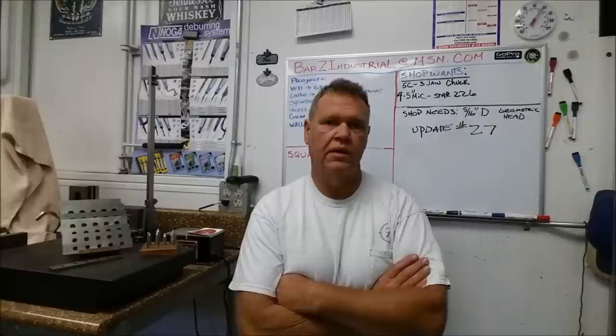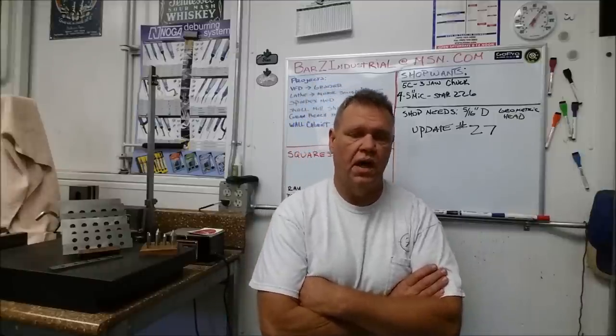Simple bearing service made a world of difference. The Boyer Schultz is good for another 30 years hopefully. I priced the bearings while they were out — they're still available, about $180 each. They're not angular contact, just a deep groove bearing in a high-tolerance spec. I opted not to replace them. I had about two hours into pulling that spindle out, re-greasing, and putting it back in — so it's no big deal to do it if I do decide to give it new bearings in the future.